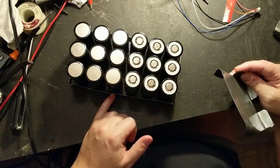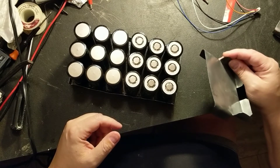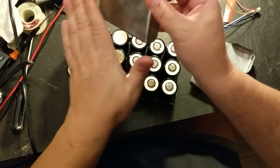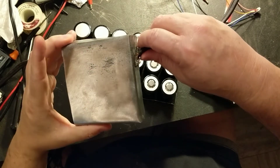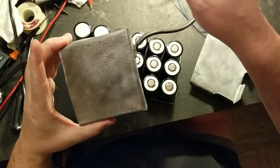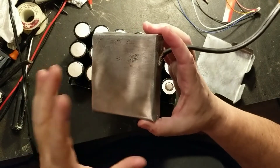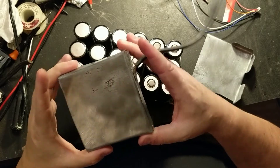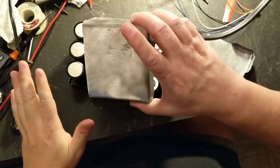The only thing that seems to get hot is the top positive and negative plates, just because of where I connected the wire — to the side, so a lot of current flows from here over to there and this part gets hot. So I'm going to address that by hooking multiple four wires, each 12 gauge. That'll be effectively a 6 gauge wire — if you hook four 12 gauges in parallel, that is a 6 gauge wire, which is more than enough for 100 amps.